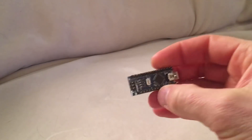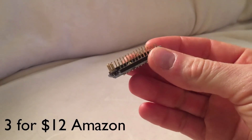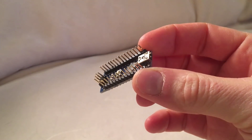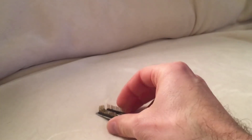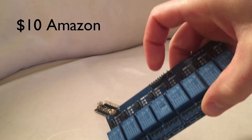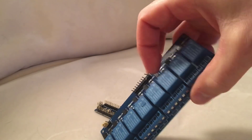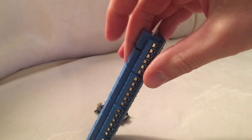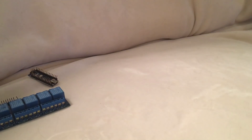The first thing I did is I purchased some Arduino Nanos. These are really small and they have pins to control up to 14 things. The goal is to control eight things, so I purchased a set of relays or solenoids. These eight pins right here the Arduino is going to be connected to, and that'll control these relays. Then here's where the Christmas lights will get attached.